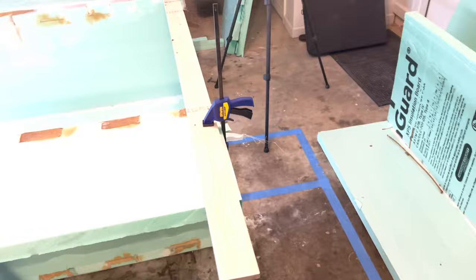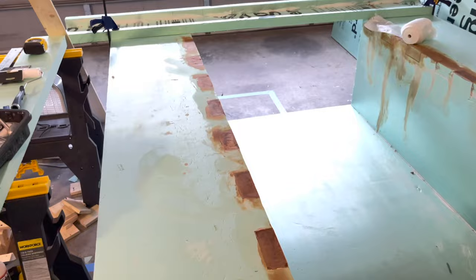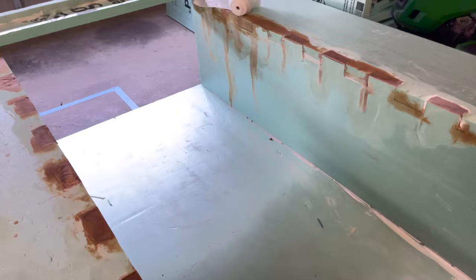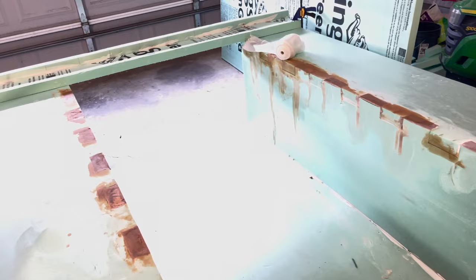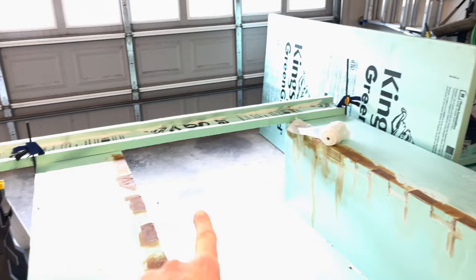So when I'm gluing these sides up from the bottom to the top and then with the wings out, it was using boards with clamps in order to measure it from one side to the other and then try to duplicate it on the other side to get it as close to square and level as possible. So, yeah, it's not easy because you're not going to make perfect 90 degree angles, but certainly you can try to do your best. And all things considered, it's actually fairly well squared, if you look at measurements. So yeah, just something to keep in mind.